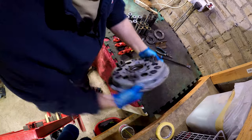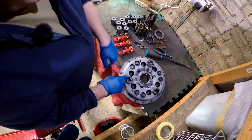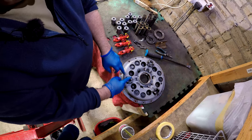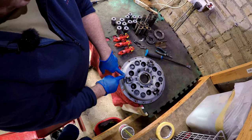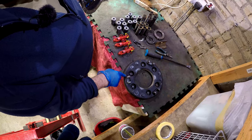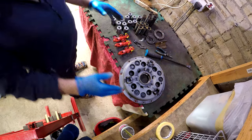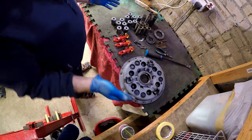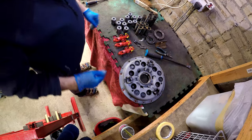Now with this cover, when I took this to bits previously, I marked them — I put a centre punch mark on the lug which is for the cast main drive plate, centre popped the cover, and I also centre popped here the PTO cover. That's so they go back the way they came out of the shop. Some of these are balanced up, and it doesn't hurt to identify the way you're taking the bits in order to make sure it goes back together the same way.